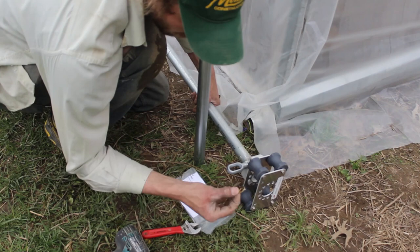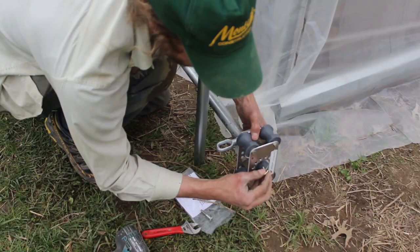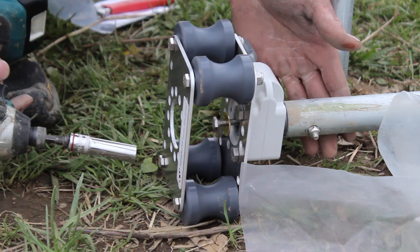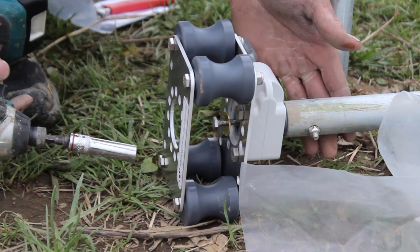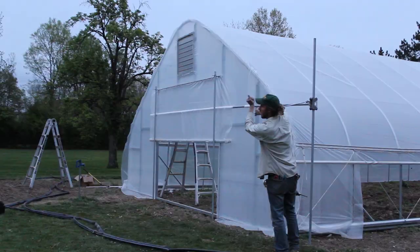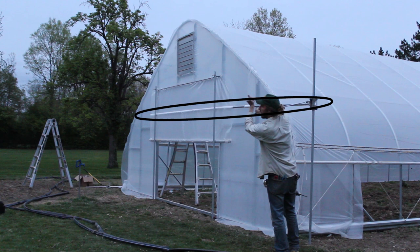We've created the ability to connect a square hole to a round tube. Now I'm going to more firmly connect the gearbox to the adapter that's in the tube. We have a bolt and a washer, and I'm threading that on, getting it in place, and pinning it in with a 7/16 inch drive socket and impact driver. Now we've assembled the large roll bar, the gearbox is in place, and we're ready to move on to the smaller roll bar.